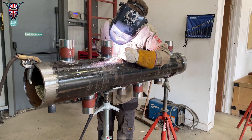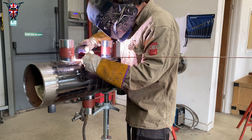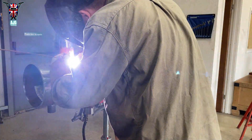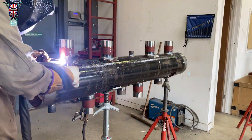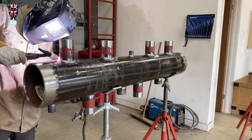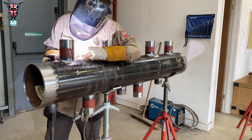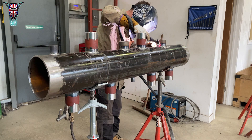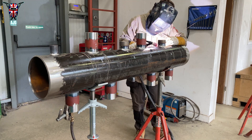I like to lay down the wire and give it a little push as I pass over the middle of the weld when doing my weave — it just helps build the weld up. These rods keep the color a lot more so you don't end up with a really grey weld. For amps on the cap, I usually run between 165 and 180 depending on how hot or cold it is. If it's just warm to the touch I'll go 160-165, but if it's cooled right down — say coming back the next day — I'll turn it up to about 175-180.